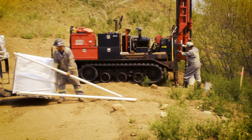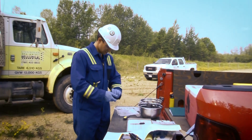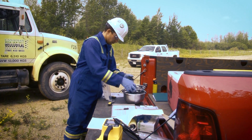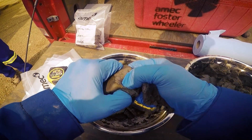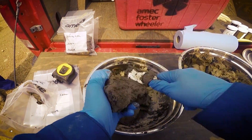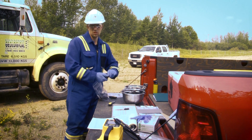There's also bacteria that can eat away at the hydrocarbons — they degrade them — so we like to get them to the lab and analyzed as quick as possible. With the soil, for instance, we're at seven and a half meters — that's the sample I'm jarring right now. I'm putting the soil into bags and jars, and I like to homogenize it a little bit just to make it as representative as possible. I break chunks off and mix it up, so when the lab techs take a sample it's more representative — because I could take a sample from the top of the jar versus the bottom and with certain parameters we could get a different concentration or reading.